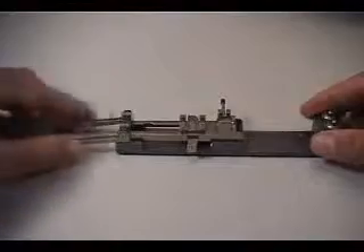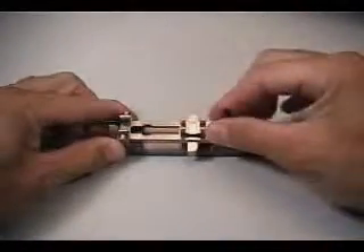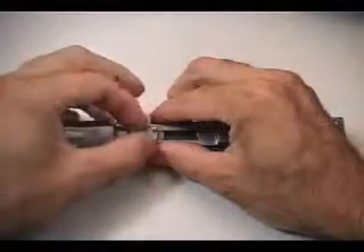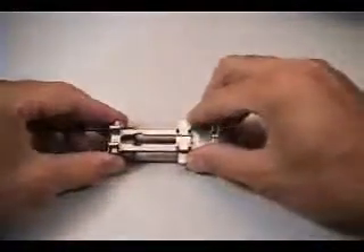Prepare the activation tool by swinging open the crimp handle and rotating the wrench lever straight up. For proper fit of the blue VFL adapter, the slider must be rotated into the wide position. While holding the spring-loaded slider over the rounded opening as shown, rotate 90 degrees.